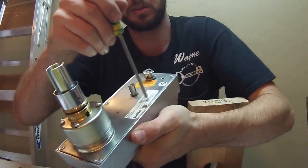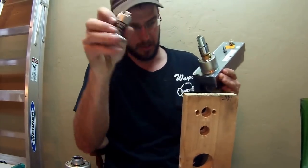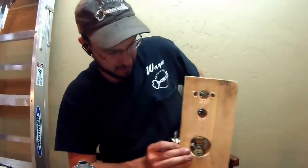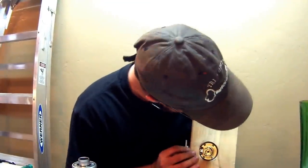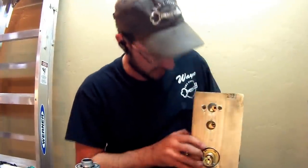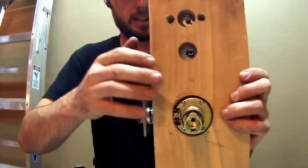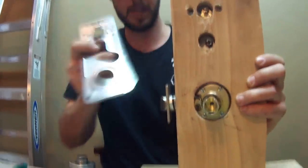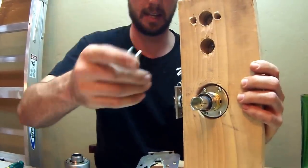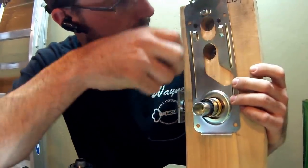When you do these, don't forget about the screw right here — there's always a screw underneath the label, so be aware of that. We're going to put the latch in — it's handed the opposite of what it was from the factory — and slide that right in there, making sure all the other holes line up as well. Then pull this backing plate and put the two largest screws in the set right in here.